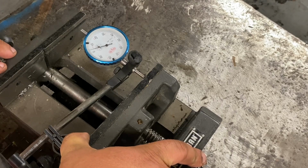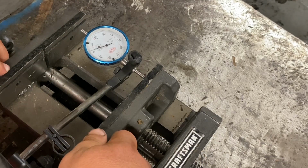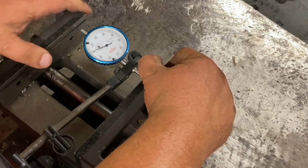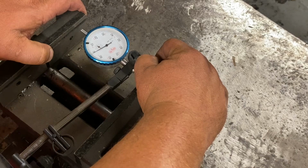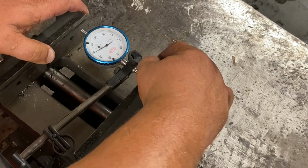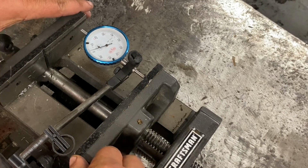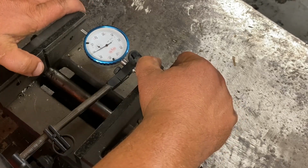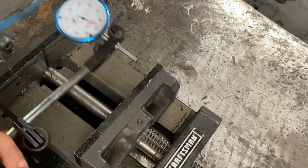And we got that squeezing good, and that's about 3 thou. And pulling over here, I get about 2.5 thou. And yeah, back to 3. So it's only got about 5 or 6 thou of wiggle. It's a very, very tight setup. That out of there.